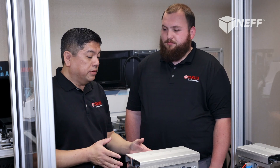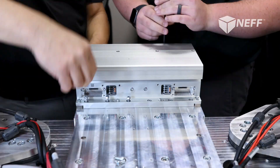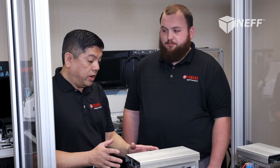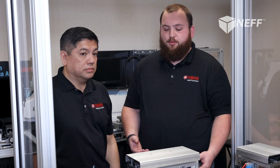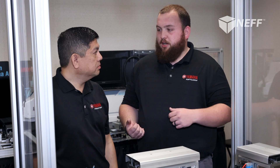All you have to do is bolt it down — with the end plates or connection plates bolted down, you seat the dowels mating surface from the module and then throw in a couple bolts. Yamaha really tried to make this mechanically easy. And when a module does go down, you just take out a few bolts, pop out the old module, and put the new one in.